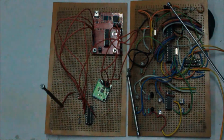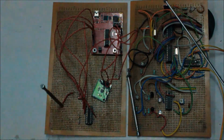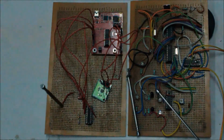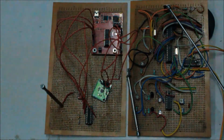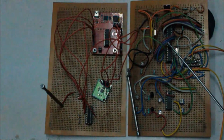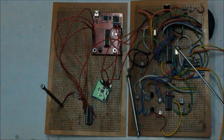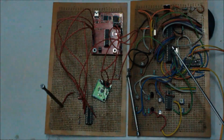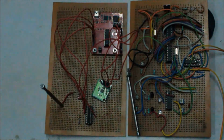Also in the circuit we have used the UA7805 IC for giving power to all other ICs in the circuit. This IC is capable of giving 5 volts to each IC, which is necessary for driving the microcontroller and the L293D IC. The UA7805 IC is again manufactured by Texas Instruments only. So this was the hardware description of my finished product used in our project.